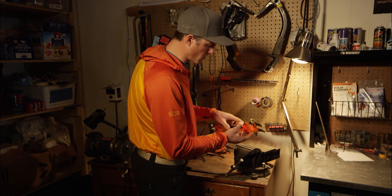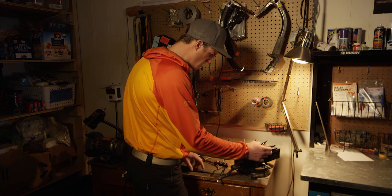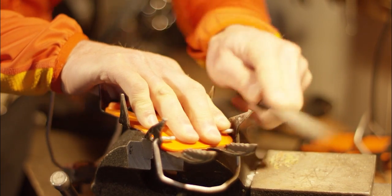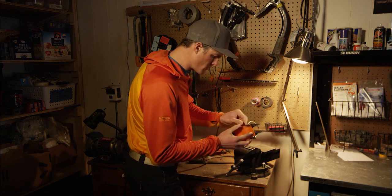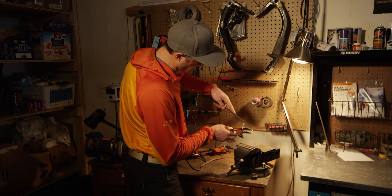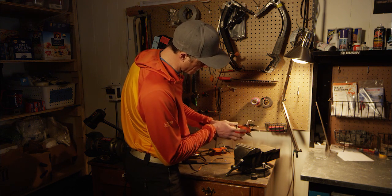The secondary points people often forget about, so I'm going to hit those up as well. It's a little harder to fit these in the vise, so I'm just going to brace it hard here. I'm sharpening in this direction on it. I don't want to sharpen the front of the secondary point, because then I start to shorten it and change the angle that it hits the ice at.